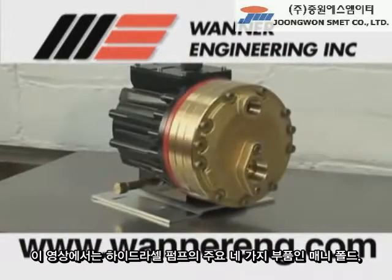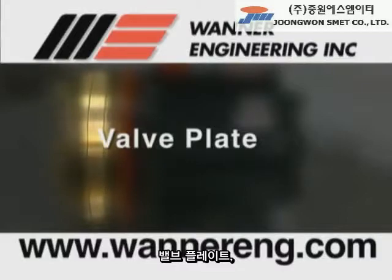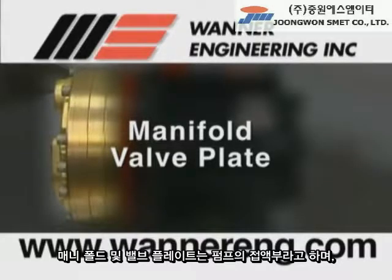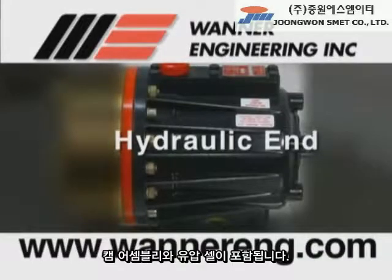In this video, the four main sections of the Hydra-Cell pump will be referred to as the manifold, the valve plate, the cylinder housing, and the pump housing. The manifold and valve plate are referred to as the fluid end of the pump and contain the valve assemblies and the diaphragms. The cylinder housing and the pump housing are referred to as the hydraulic end of the pump and contain the cam assembly and the hydraulic cells.